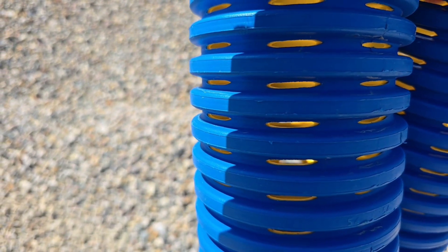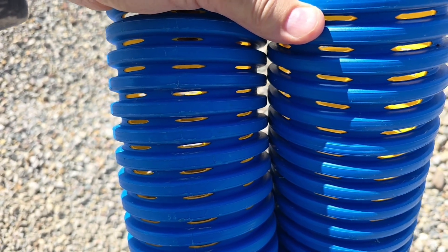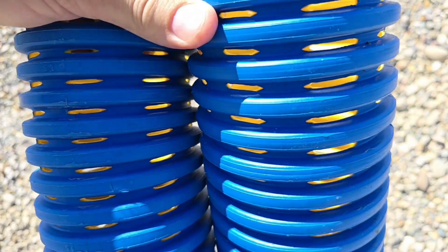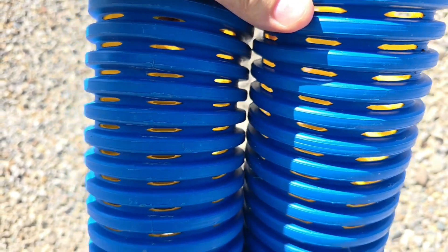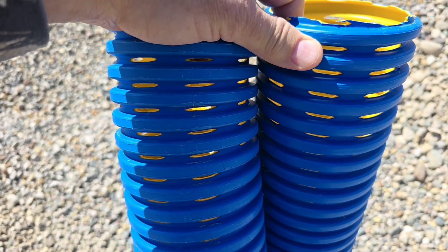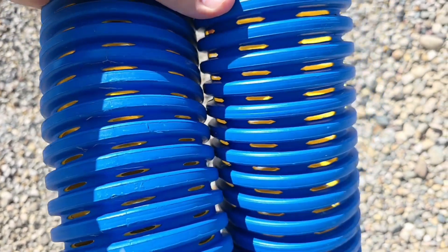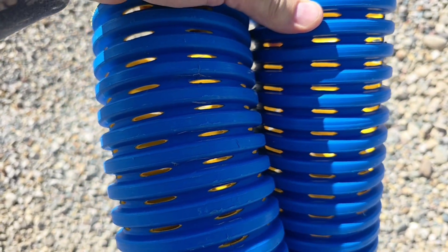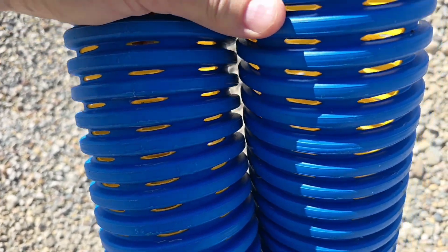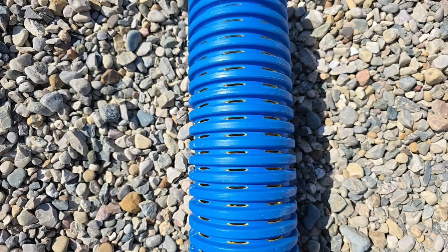Contractors putting in two pipes give you the insurance that if some inlets get clogged or compromised, you're still going to flow as much water as you would through a perfectly good brand-new perforated pipe. Not only does it give you that insurance, but you also have a wide enough trench to circulate more air. Having two pipes moving more air dries out the yard quicker, and you want to keep the trench dry so you're not growing soil-bacteria-born gels and other things that'll clog your pipe.